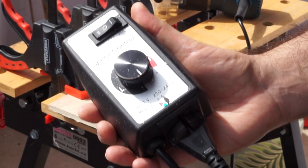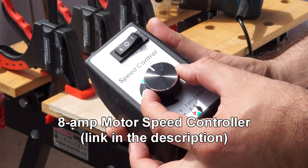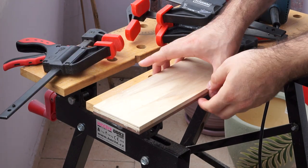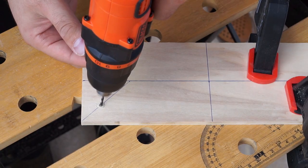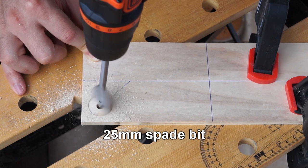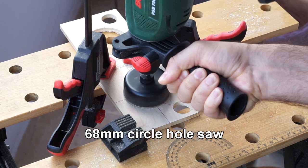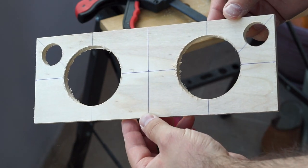I should mention that for this project I bought a motor speed controller. My router doesn't have any speed controls — it only goes at full speed — so I needed to slow it down somehow so that it doesn't damage the wood. I now had a piece of plywood exactly as big as the walnut piece that was going to cover it. Next I had to drill holes into the plywood. First I used a spade bit to drill holes for the bass reflex ports, and after that I used a hole saw bit to cut openings for the drivers. The cuts weren't pretty, but they didn't have to be because they weren't going to be visible.